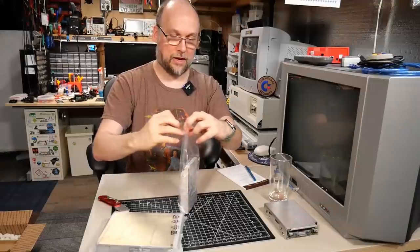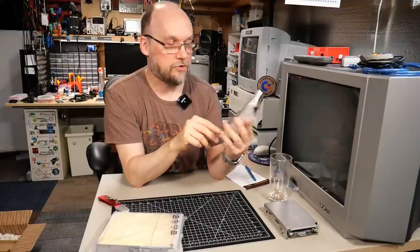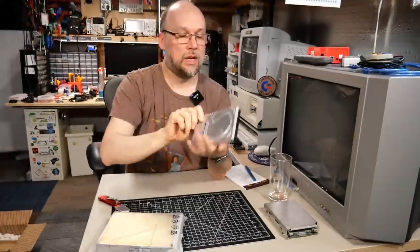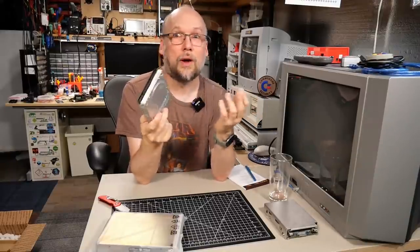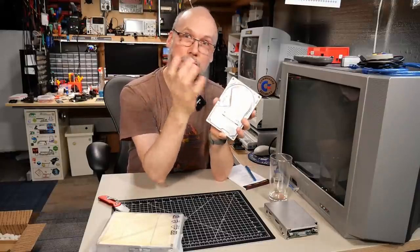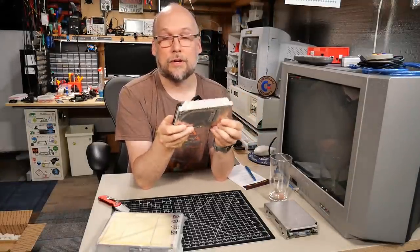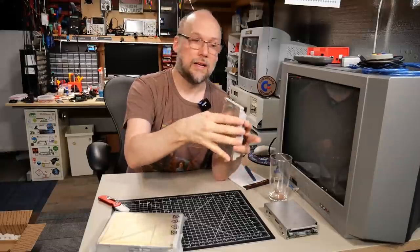He also sent along a Quantum hard drive. I never turn down SCSI hard drives. This is an Apple-branded 160-megabyte SCSI drive — typical Quantum ones, generally pretty reliable. Having these small-size SCSI drives is very useful; I have quite a lot of Macintoshes and they all use SCSI drives. I also have some Amigas with SCSI interfaces. While you can buy SCSI-to-SD adapters for around $65–$70, sometimes it's just easier to install a hard drive like this.